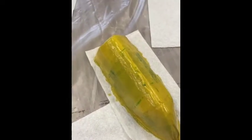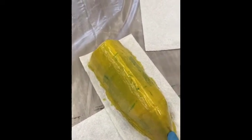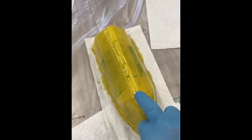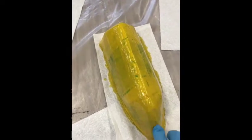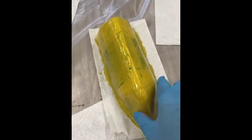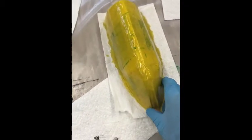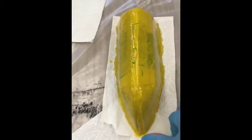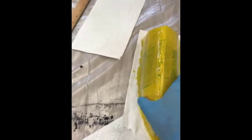Now, we talked a little bit about it. It's not a smooth surface because we didn't have a mold. Plus, the vacuum bag shrunk the laminate very tightly around the foam board, and we didn't try to match that up as carefully as we could have, because I'm trying to show you the process, not a fancy boat. So this would be structurally sound and watertight. But if you wanted a really good looking boat, you'd need to spend more time to match this up. Also, we could make a filler and fill in some of this stuff, then sand it down, fill it in, sand it down. Other than that, it looks good, and it's lightweight but strong.